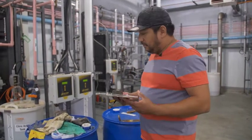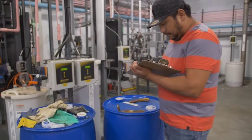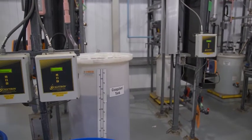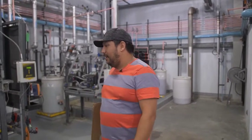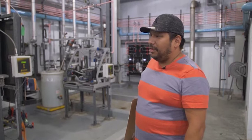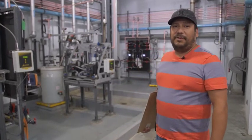This one here labeled coagulant tank — it's actually ClearPac 180. This is our primary coagulant. We're pumping this into our raw water as it's going into our clarifier — we'll look at the clarifier a little bit later. We try to keep it right around a dosage rate of 160 milligrams per liter. We do tend to change it when water conditions change, and we'll typically do a jar test first to see what dosage rate works best.